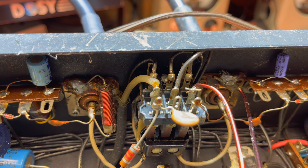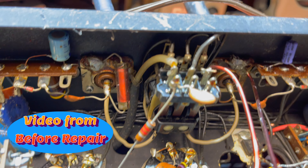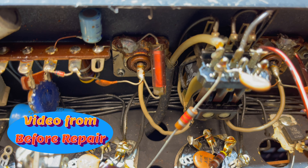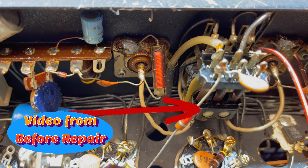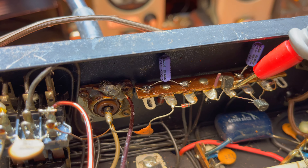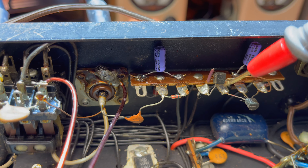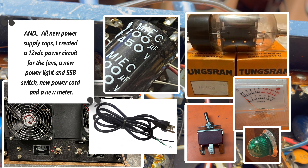This is an old Elkin amplifier that had a relay keying problem. I was demonstrating this to Troy in Florida, the owner — I said as I touch this spot on the transistor, the amplifier keys just fine. So that's the circuit that was bad, and we need to address that circuit, clean it up, and add some cooling fans because he talks a lot and wants to make sure not to overheat it. So that's what we did — we fixed that circuit and added some fans.